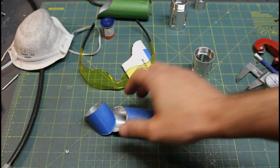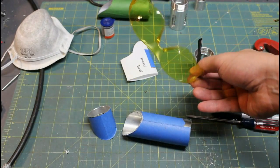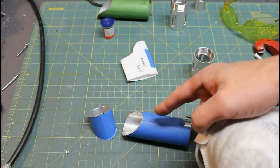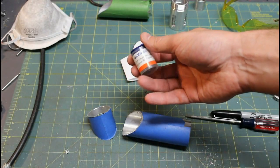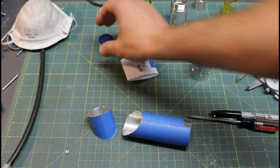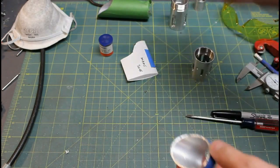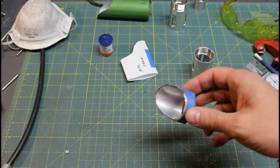I've finished my cut. When you're doing any of this Dremeling, safety glasses are incredibly important — good quality safety glasses — and a dust mask as well for this job, because there's a lot of aluminum bits and dust from the cutoff wheel. These are Dremel number 409 cutoff wheels that I use for this type of job. There's my shroud piece, it's cut off, so I'm going to store that away in my box of parts, and this is the rough cut of my shroud.